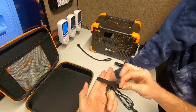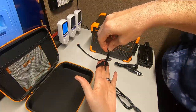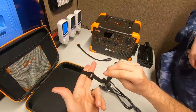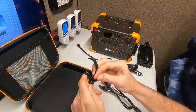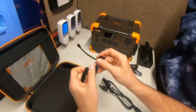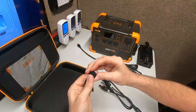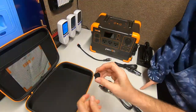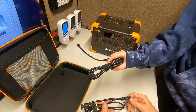You get four of these and you can toss them in your bucket. The best part is they keep cables together without putting too much pressure on them or getting them tangled. When wrapping cables, the best practice is don't squeeze the ends tight — that rips the copper inside. Keep a nice bubbly arc; you can squeeze the middle as long as it has what I call the 'bow tie' look.